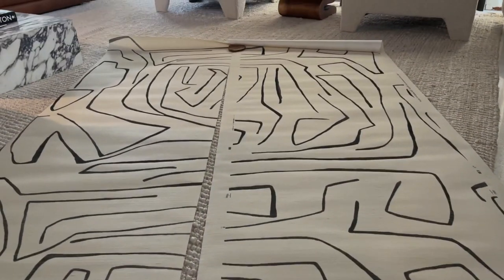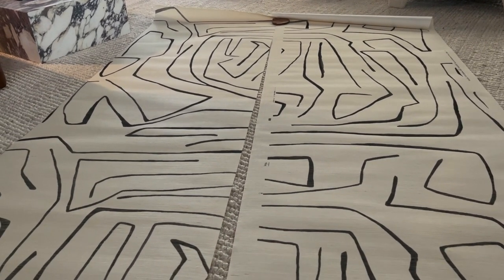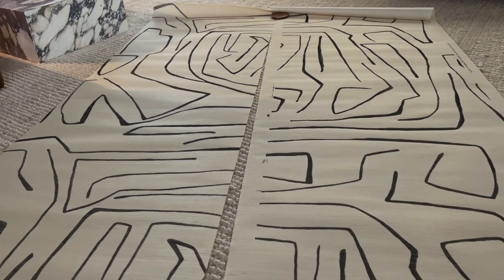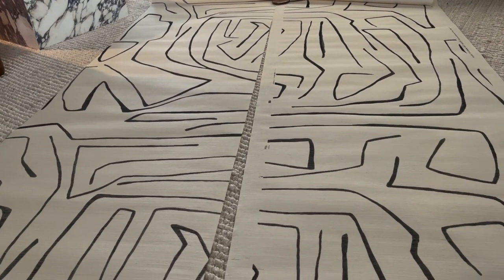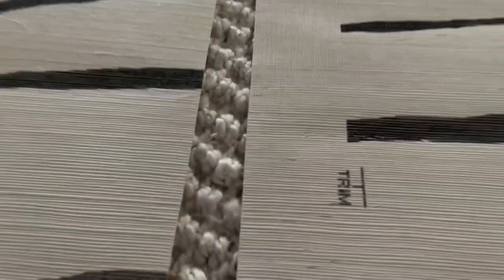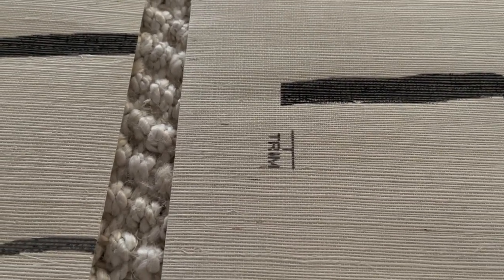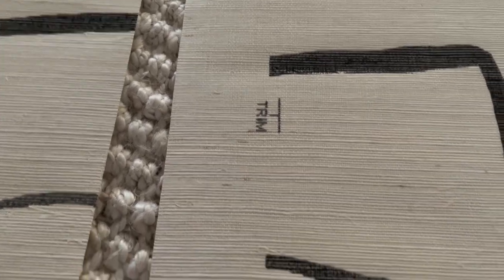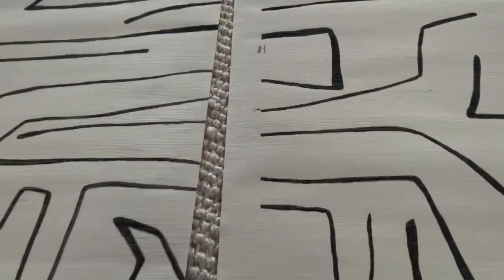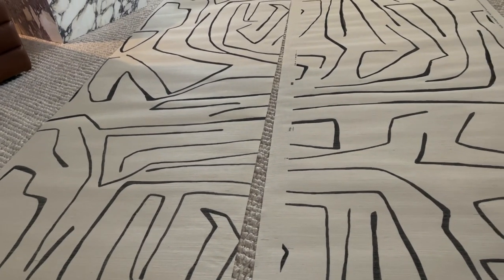Because unless you have a lot of experience with wallpaper, you'll mess this up. An otherwise good wallpaper hanger just starting out is going to ruin this product because they're not going to fully cut that line. You see that line right in the middle of your screen? You have to completely cut that off. Completely. And if you don't, you're in trouble. If part of that vertical line shows, you're in trouble. And everybody's going to know what it is. It has to be completely cut off. Your cut must be precision.